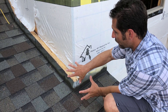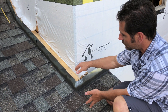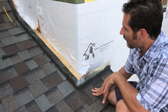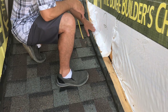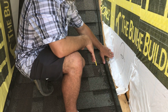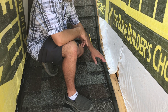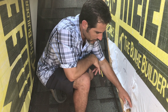Typically, they don't even put caulking. They just cut the metal, fold it around, make it look pretty on the outside, and then what's underneath the brick, they don't care about. So there's usually holes and voids that are in these areas, as well as when you transition roof pitches. When they come up here, they're going to have to cut this metal to make it bend. So this is a vulnerable place — that corner is very vulnerable, and there's no telling how they're actually going to finish this with the house wrap.